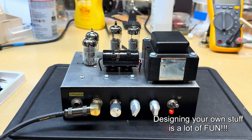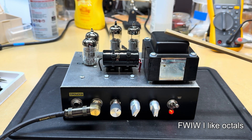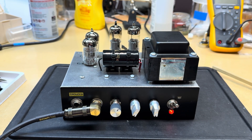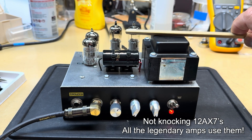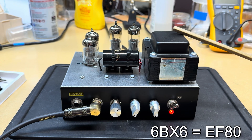Design-wise, when you're designing an amp you can decide any way you want. I ended up picking 12AX7s because they're ubiquitous — they're probably not my favorite preamp tubes, but I had a bunch of current production stuff lying around that I never use, so I figured I'll just put them in rather than my really good tubes. I looked at a whole mess of different pentodes looking for something that would put out no more than about a watt and a half to two watts maximum.